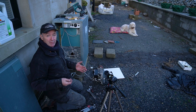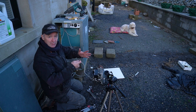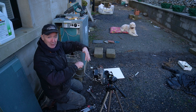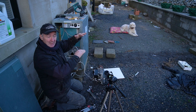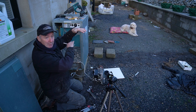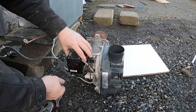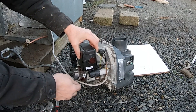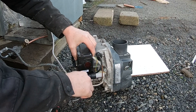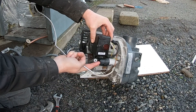So just to recap on this. Very often if you've run out of oil, the system won't kick in again because you've sucked air down the line and that air needs to get out. Generally if your tank is done right — if your tank is higher than your oil line — the oil wants to flow. The kerosene or diesel or whatever you've got wants to come down the line and get out; it pushes the air in front of it. So this is like a bleed screw here on this thing and you can just crack it. You can see the kerosene running out of that.